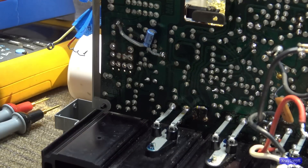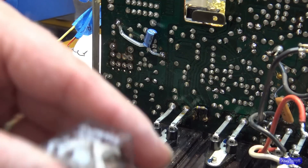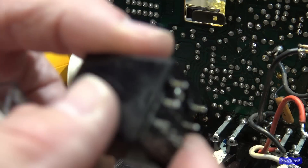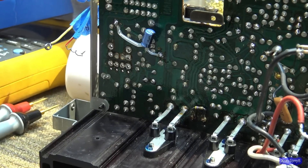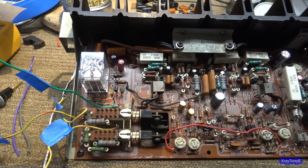I'm just going to replace this relay. My buddy Dave — this is his unit. You can see this has been pried off, so obviously somebody's tried to clean it at some point. So I'm just going to put a new one in. Dave got this one for me and I think it'll be just fine. The relay is replaced, all the capacitors are done, and the transistors in the power supply are done. I cleaned all the controls and the board.